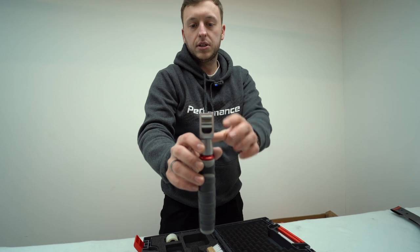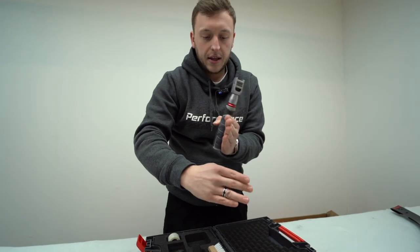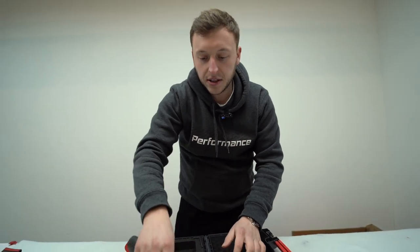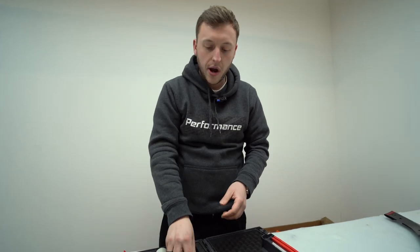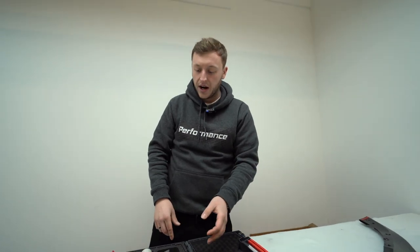But you can see here, this has sharp edges. What we would do is cut a kind of slash, a hex, a grid. So you cut that into the lacquer. This is set at a certain depth to make sure this meets OEM manufacturing. So we've got some data from the likes of Bentley and stuff that we kind of meet.